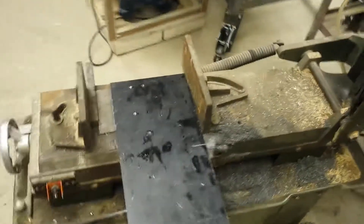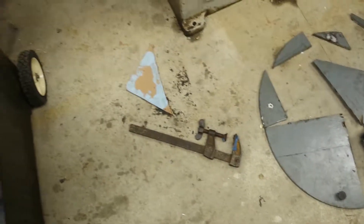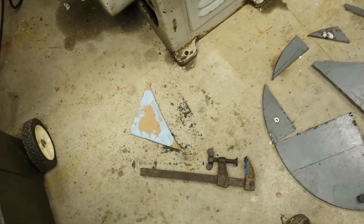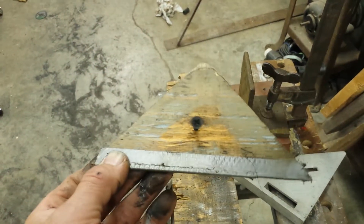To make the odd-angle pieces, I put them in the vise, placed pieces on top, and used clamps to hold it at the angle I wanted, then cut. That's the raw stuff — all the big cutting is done. The next step is to get these all exactly the right size and matched up to a model that fits inside the angle iron on the back of the machine.